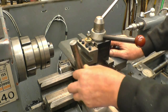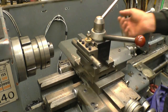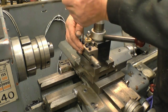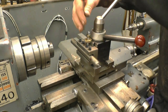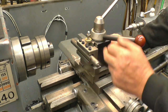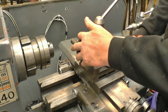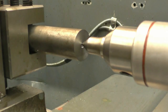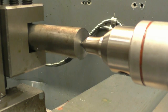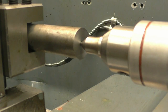The first thing I'm going to do is set the job at centre height. I've centre drilled it, so it should be easy enough to set up just by using a tailstock centre. I'm just using the tool post because it's easy — I haven't got a vertical slide, though I do have an angle plate. For this particular demonstration this will work perfectly well. I'll ease it up until we get it just about right — good, that's going right in the middle of the hole, so I know the job is on centre height.